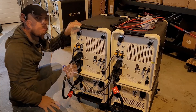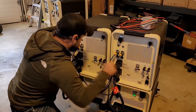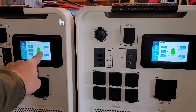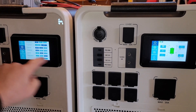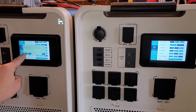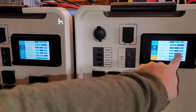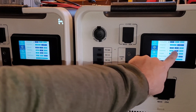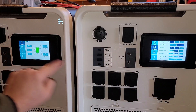We'll come back to doing the solar connections. Right now we're ready to turn everything on. I'm going to flip open all these plastic covers and turn on each unit simultaneously. The screens will flash and then we need to reset the inverter. I'll push the finger button, go to settings, and go from parallel mode single phase to split phase — click P1 on one unit and split phase P2 on the other. Now we see 2P1 and 2P2. I push the flashing button and we're back to home.